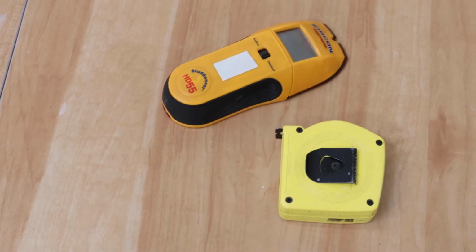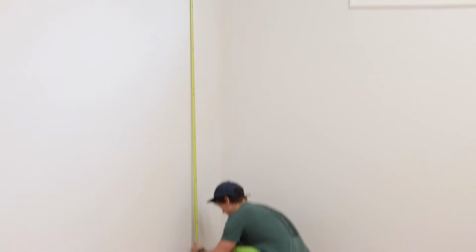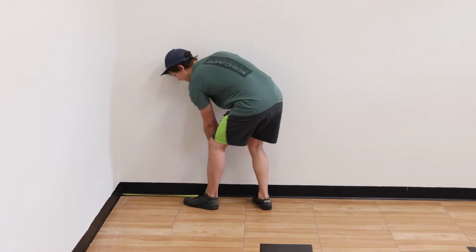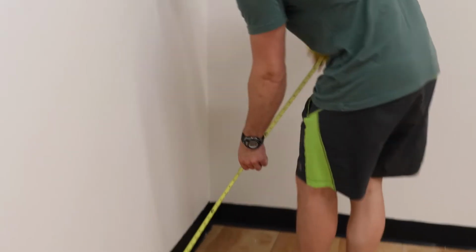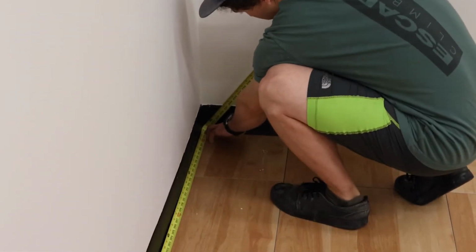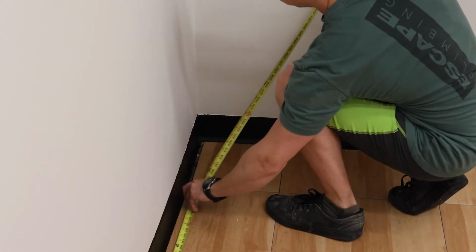Once you have everything you need, you'll need to take some detailed measurements of the space where you'd like your wall to be. First, start with the ceiling height. Next, measure the full width of the wall at different heights. It may surprise you to learn that while walls, corners, and floors may look level, straight, and at the perfect 90-degree angles to one another, we found that reality rarely lives up to that appearance.